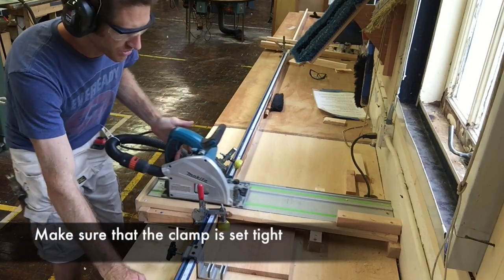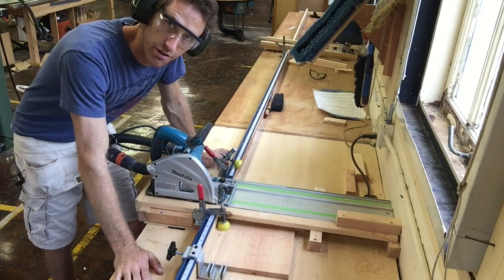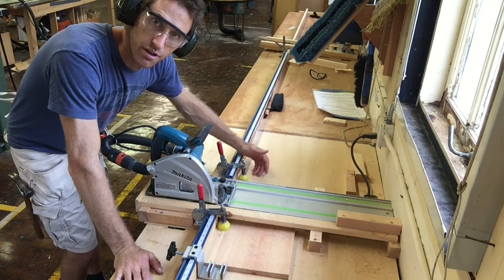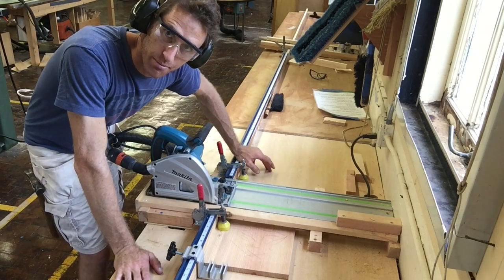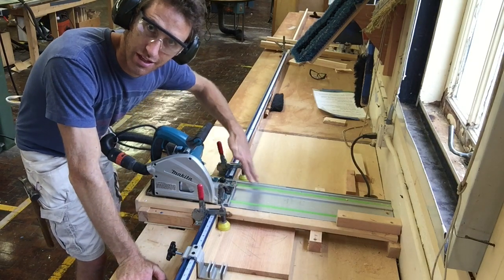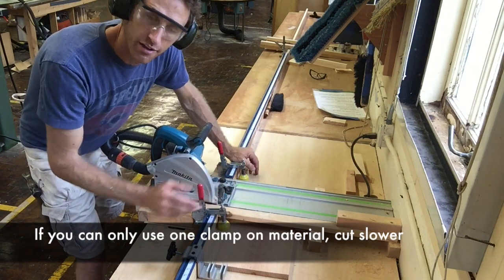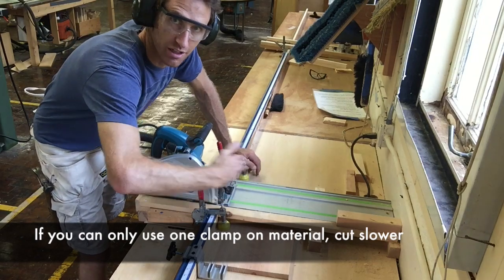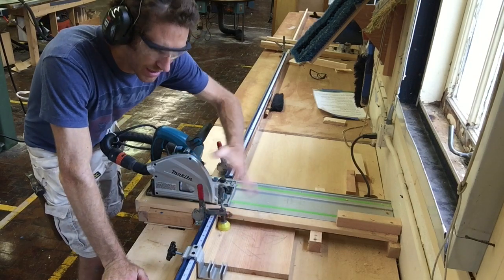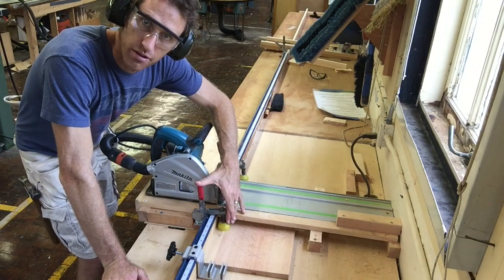Now, you want to make sure your saw is pulled all the way back. In this instance, I'm not taking off enough from my material to warrant using the second clamp because there's no material over here. So if you only have one clamp on your material, you want to make sure to go a little slower than usual, because the saw has more tendency to pull the material out since it's not clamped on either side of the blade — it's going to have a lot more pressure trying to kick it around. The material is clamped tight against the stop, the stop is set to what I want, and I've got my clamp really tight.